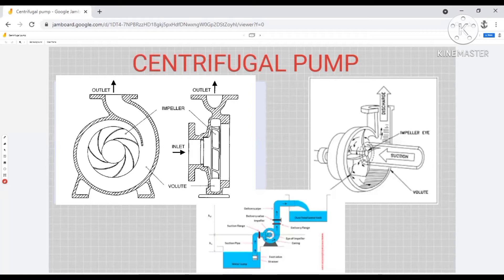Now you see the scenario here. The water that was present inside the casing is now discharged from the discharge side. So what is at this space at the impeller? You might say there is air, but the pump will be primed so there will be no air present in the casing. So a very low pressure will be generated. As the low pressure is generated at the eye of the impeller, atmospheric pressure is acting on the water in the tank.